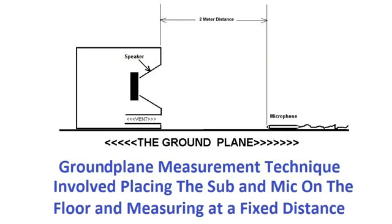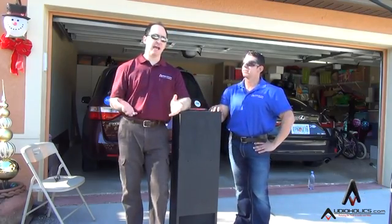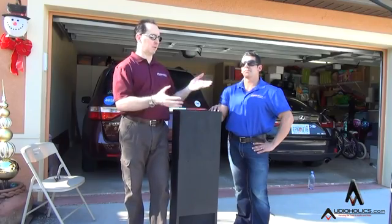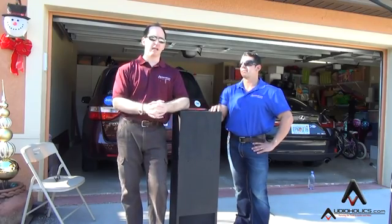Some people are going to ask if these are the best conditions to test this. No — just like the Kobayashi Maru, we change the conditions of the test to suit our needs. The ideal way to measure a sub is in an open field, because anything below 40 or 50 Hz has very long wavelengths. We have a garage only about 10 feet away, so we will get some reflections. Normally we'd place the mic two meters away, equidistant from all drivers and ports, but since we don't have that luxury, I'm measuring at one meter and scaling 6dB off so it looks like a two-meter measurement.